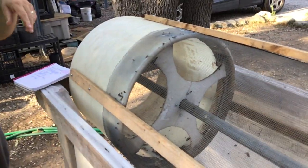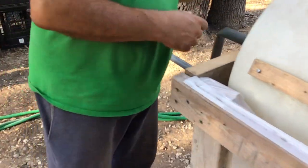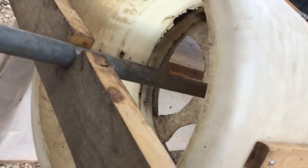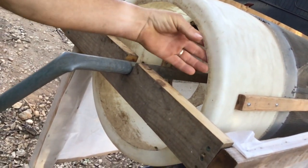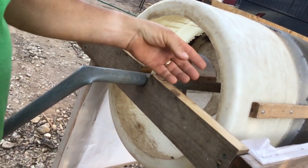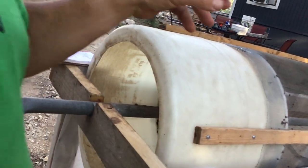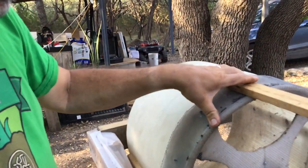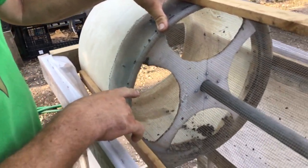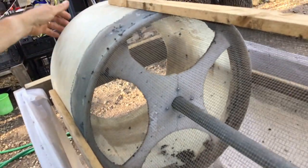The way I did this: first I cut the barrels one-third off one end. The bottom part of the barrel, as you can see here, I used because I needed to leave at least an inch and a half of the bottom so when we put material in, it'll catch it. As you're spinning it, the material tends to come back a little bit — this will stop it from dropping on the ground. The other top part I took and made this with it — I cut four half-circles and left enough material to keep it very strong.